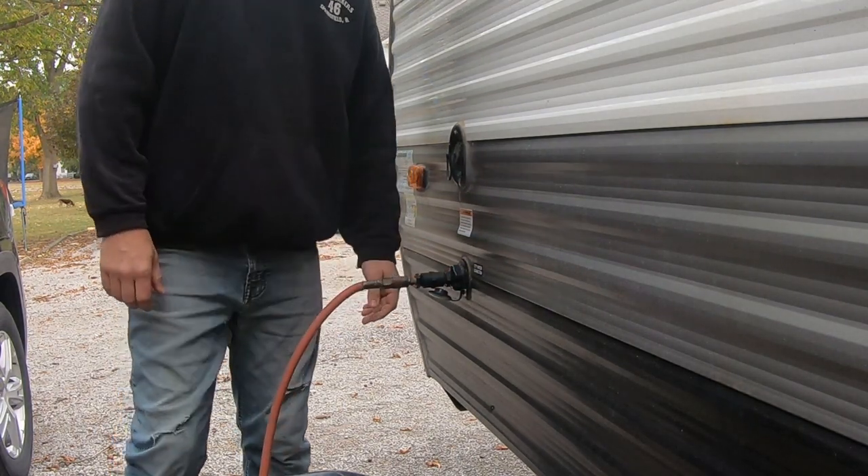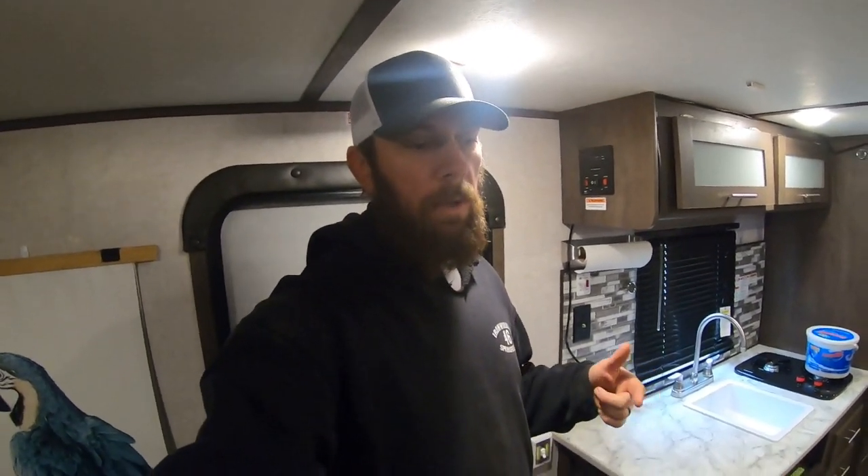We've made it back inside. The air compressor's hooked up and running — I picked that air compressor because it's not as loud as my other one, so if it does kick on while we're doing this it won't be a big deal. One thing to note: if you've pulled the anode rod out of your water heater, put it back in. It doesn't have to be super tight, but it'll just blow air through until you hit the bypass line on the back of the water heater. Coleman did put a bypass hose kit on this water heater.